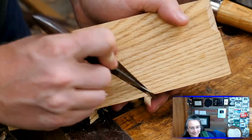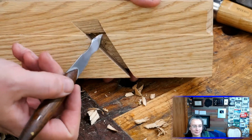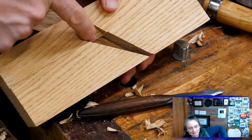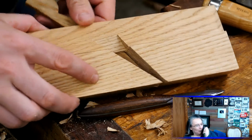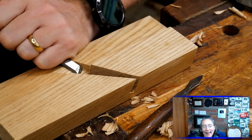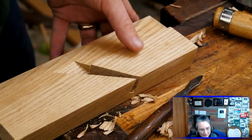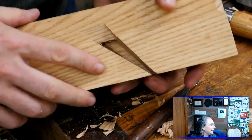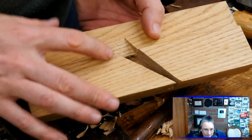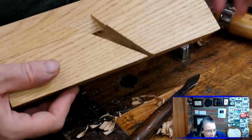And just like that, we've got ourselves a little slide in there so that all the chips can now eject out this surface here without getting jammed up in the edge. So when we put in the wedge, we have a nice transition off of the wedge onto this without having a hard stop right there. Now if I wanted to, I could come in with the chisel and be very, very careful and slowly take off a little bit here and just clean off all of those shavings. May even bring in a file and scrape it all down and smooth everything out. But I don't have time for that right now. If I really wanted to do all that detail work, I could. Is it going to matter at all? No. From this point on, everything else is just a little bit of detailing and shaping. So we just want to get things functional. And from this point, it's a fully functional plane. You really don't need to do much of anything more.